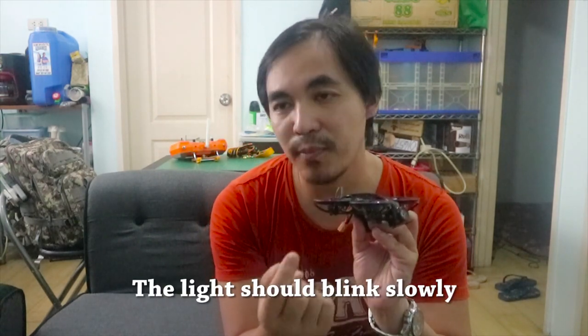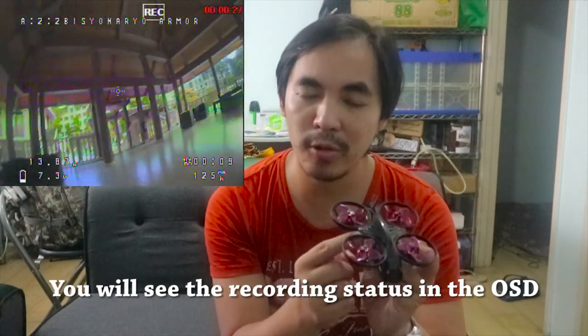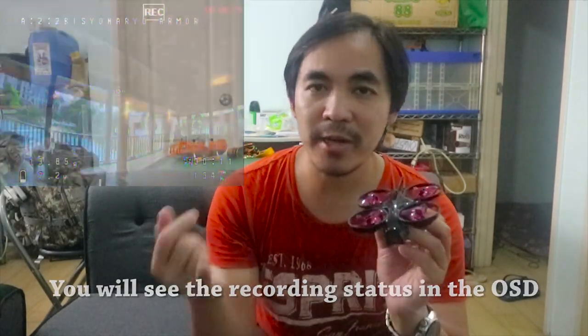So if you are watching this and you've never used the Caddx Turtle before, when you have it turned on, you have a solid red light on your Caddx Turtle board. You press the button here on the side, and that will start recording. And you press it again to stop. And then if you want to turn off the Caddx Turtle, you hold that button for 5 seconds. So holding it for 1 second to turn on and holding it for 5 seconds to turn it off, that was in the manual, but stopping and starting the recording, that wasn't indicated.